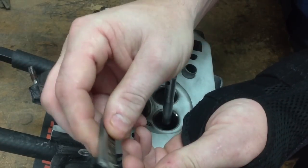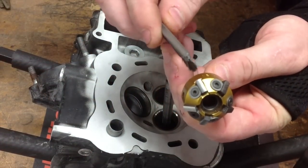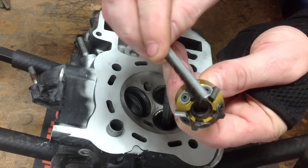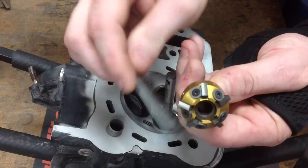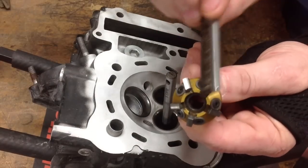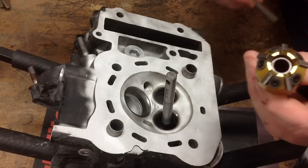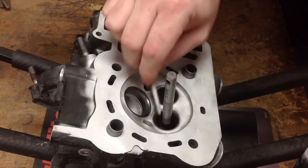Those blades will fill with dust, so when he puts his cutter head back onto the seat, if he does not sweep that off, it'll get trapped between the cutter head and the seat and could actually leave a score around there. So it's imperative that every time before making another cut, you sweep those off and clean them. The seat also needs to be swept off, so he'll use that same brush or compressed air to clean that area up.